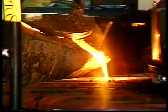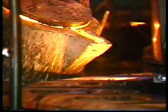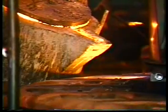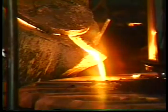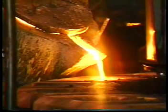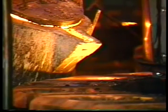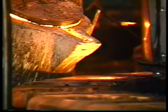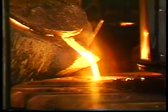Molds on the turntable are gently indexed one station at a time to the pouring position. This indexing is accomplished by the use of a Geneva Drive, which provides a smooth, controlled motion from start to stop. The two most popular turntable pouring methods are as follows. Single station pouring: molds are poured continuously at the same rate they are transferred onto the table. This method produces maximum cooling time but restricts pouring speed to the turntable cycle rate.